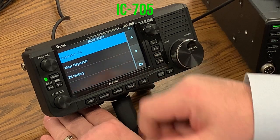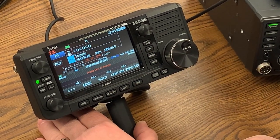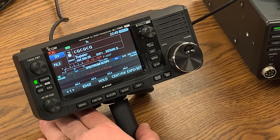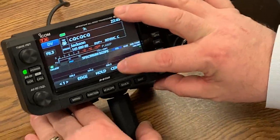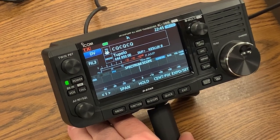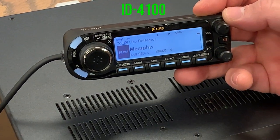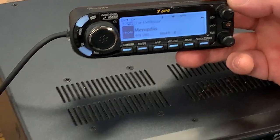So you've got a GPS lock here. Near repeater — we'll go all. Shows you your distance to the repeater. And — here we go. Scan near repeater, DV or FM. Again, you're scanning both VHF and UHF — that's why 'scope out of range' comes up. We're in fixed mode; we can go to center mode and it will follow the center frequency, so when it's changing bands. We come to the 4100. The 4100 is already in that scan mode. It is a single-band D-Star analog radio. The functionality is very much the same as what you have on the 5100.